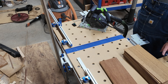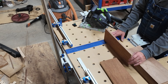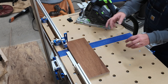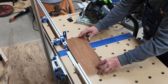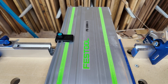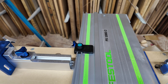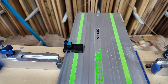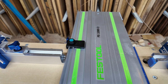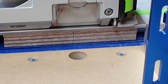The situation here is a bit different than the previous video because the trenches I need to cut to go halfway through a 6-inch piece for a half-lap joint are about 3 inches, and my track saw can't cut a 3-inch depth. So what I'm going to do is lay the boards down and cut them sort of the regular way like a cross-cut, except I'm going to stop the cut about halfway through. To help me stop the track saw at the same point every cut, I've installed a track saw guide rail stop. I got it from a place called Tool Curve — I'll put a link in the description. Anything you could firmly latch into the slot on the top of the guide rail would work, like a clamp, but this is what I had.